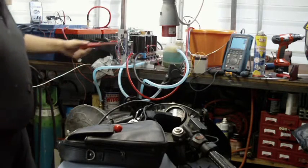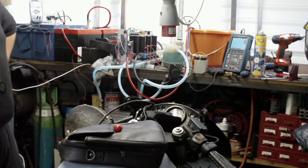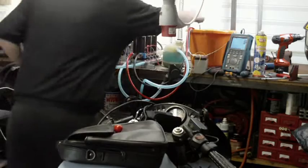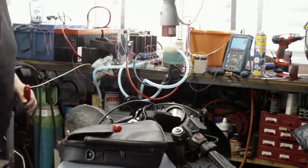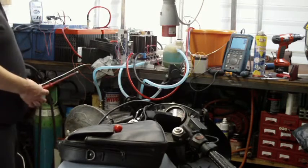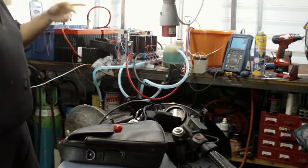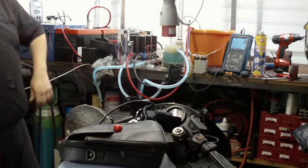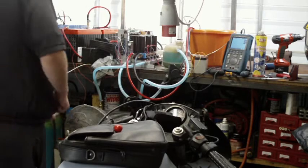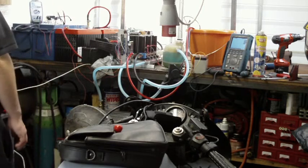So in here I've got my inductor bank. I had to cool them in a bucket of good old H2O, and I still cooked some of the cables there, and it's getting to be quite tepid in there because I've been doing a couple of tests. Now what I've found here, I've got the portable oscilloscope hooked up through the diff probe onto the collector emitter of the switch IGBT, and I've got my throttle, power, all that set up here. I've got the computer on here too, so I can keep an eye on things like currents, temperatures, all that sort of thing.